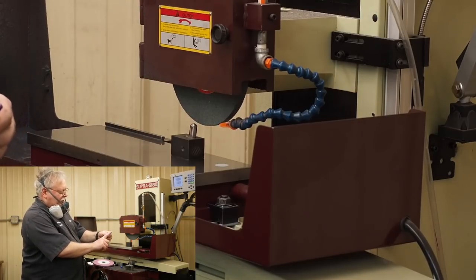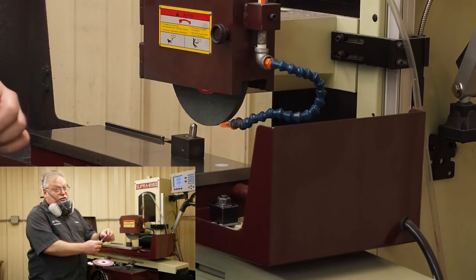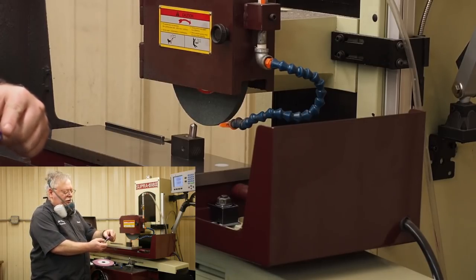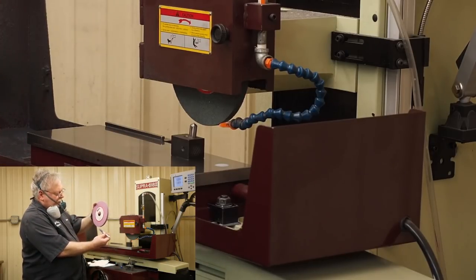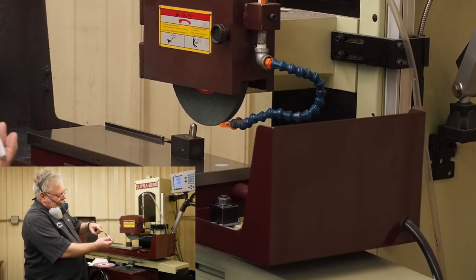and it's on the center line of the steel shaft that's on there. So every time you turn that to get a sharp edge, you can't get a sharp edge because you're grinding the flat on the center line of that pin. On the other hand, if I exaggerate this and you had an angle over here and you dressed your wheel, what would be happening is you would be wearing a flat not in line with the center line, but you would be grinding the flat this way.